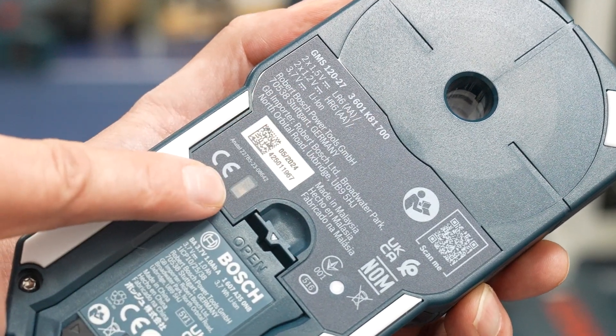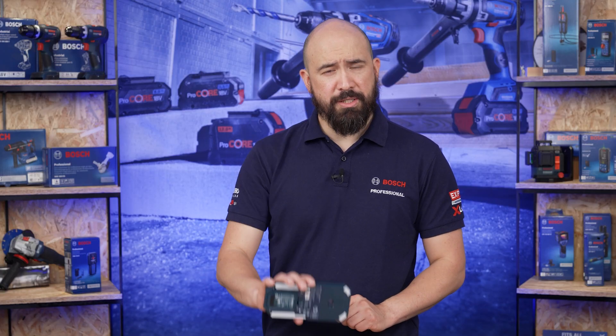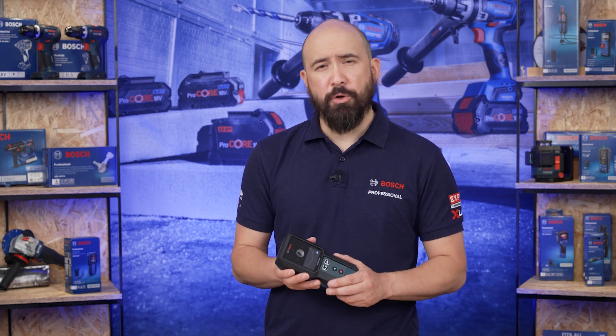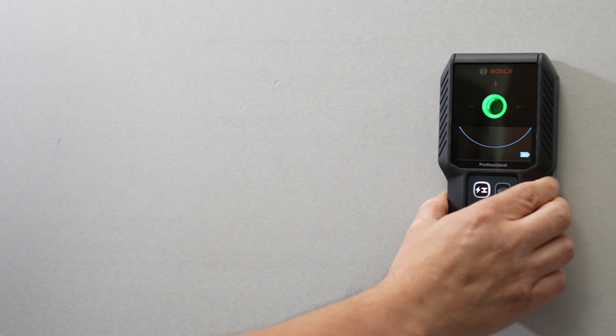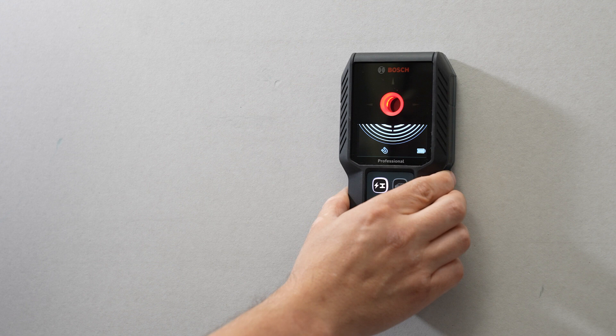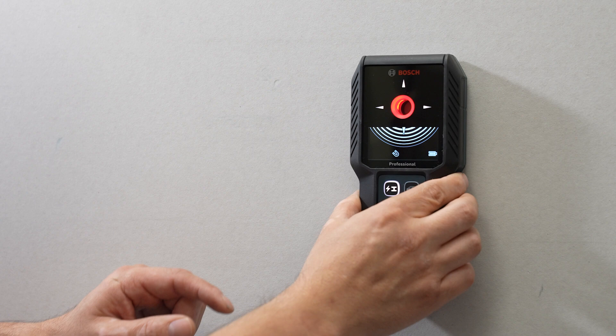Once the appropriate mode is selected, place the product in contact with the wall and begin scanning. There is a small sensor on the back that needs to be in contact with the wall before the tool activates. Move the product in left-right passes or up-and-down passes. Avoid moving the tool diagonally or in a mixture of x and y axes in a single pass. The recommended number of passes is a minimum of three to get the most accurate results. If there is an object in range, the ring will turn from green to red, together with an audible alarm tone. The screen will indicate using a number of rings to correlate the proximity to an object within the wall — the more rings displayed, the closer you are. Once you are over the centre of an object, all the rings will be lit up and all four arrows will also be illuminated.